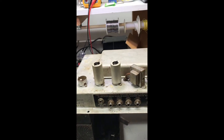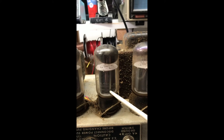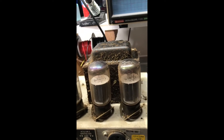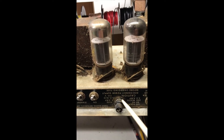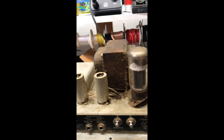Let's look on the other side and see what the filter caps look like. Now we're looking at the bottom side of the amp — some people call it the top, but this is a Twin Reverb, it hangs upside down. Right here I noticed these 6L6s were specially made for their Super 6s, and some PV amps shipped with these — yep, this has a PV logo on it. So these were pulled out of a PV amplifier, probably after they were pretty toasty, and stuck in here to work. Also, when I checked the fuse on this amp it had an 8-amp fuse — it calls for a 4-amp slow-blow fuse. So there was probably a problem blowing the fuse and someone just put a bigger fuse in it, which happens all the time. You see a lot of filth — this was outdoors or in a garage or barn for a long time. I found a few spiders too.